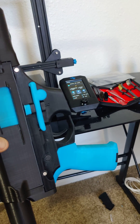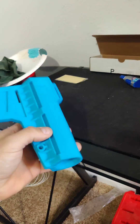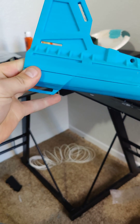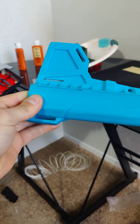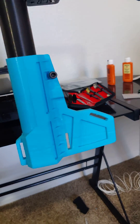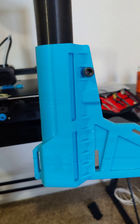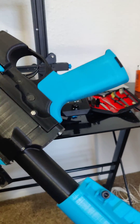Another thing is my shockwave blade broke, and here's my old one. You can see the seam where the layer lines are printed — it had snapped right there when I dropped it, and it cracked the whole tube. We printed it bottom to top this time, set it horizontally, printed it vertically, and the layer lines are going left to right when held this way. Should be a lot stronger, should be no delamination.